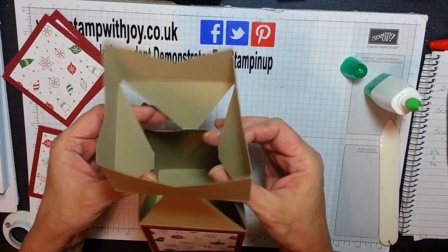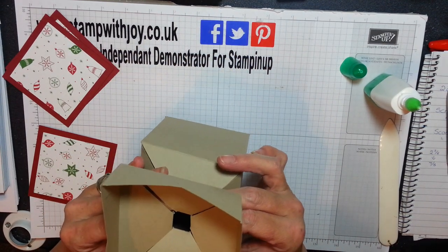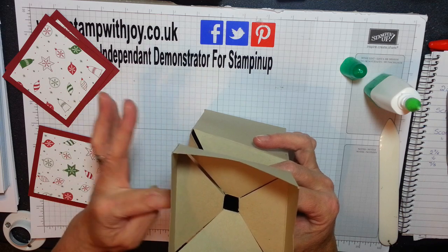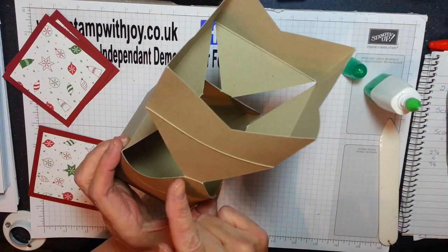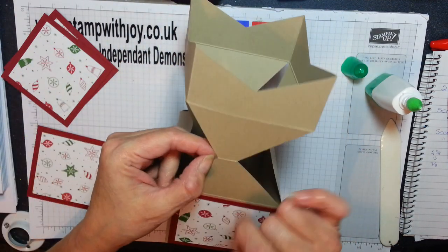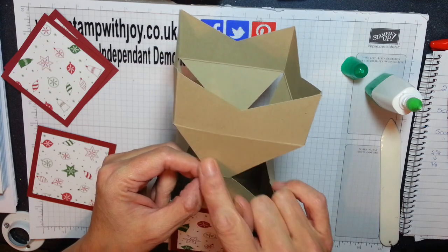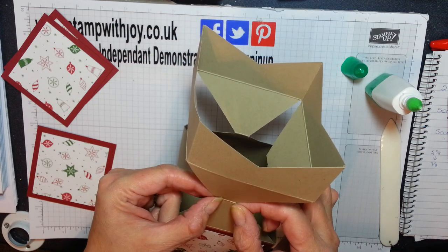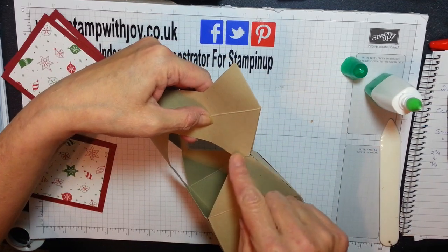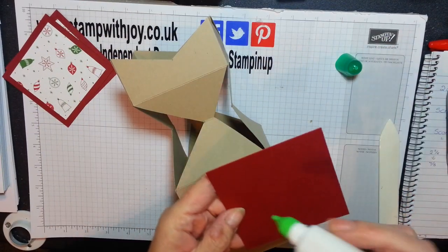Yeah, I can see it straight away as soon as I opened it. That fit side fits perfect. This one is now twisted to try and keep itself in. So I'm going to have to make this a little bit bigger. I think what it is with the gap on my original box, it was only something like 3/8, and I've gone over to 1/2 inch, which totally messed up this measurement, so it needs to come down a bit more. So what I might do is open my box and cut that angle a little bit wider, and then pull this one back on the next box. Yes, definitely, I know where I've gone wrong.